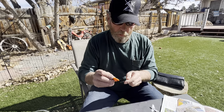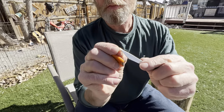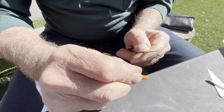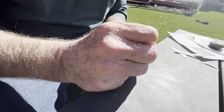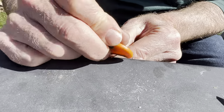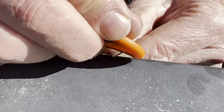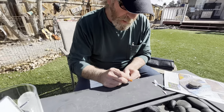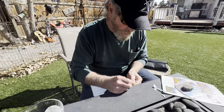I go around the last eighth to three-sixteenths of the radius off of the point. I always set it down like this — my hand is touching the table, the countertop, my leg, whatever it is — so it pivots perfectly, like a machine working on it. I land at the exact same angle, bevel degree, whatever you want to call it, with every touch. Set it down, move it back, set it down, move it back, then come out here and turn it over and do the same thing on this side.